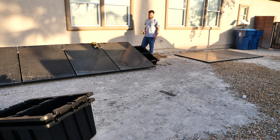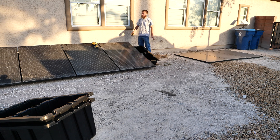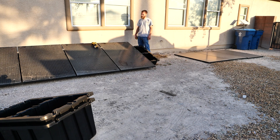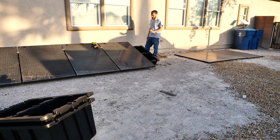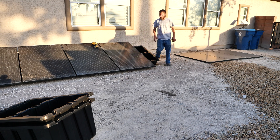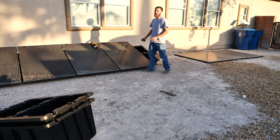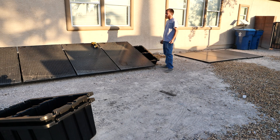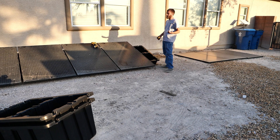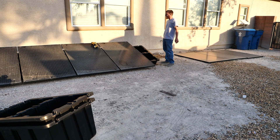As you can tell, the longest time is going to be taking these and filling them with gravel. But the general concept of actually mounting the panels is extremely easy. I am really glad, however, that I'm not filling these with gravel yet, because there is a little bit of adjustment. For example, my measurement off the house has drifted about two inches. With these not filled yet, I can literally take the whole rack and fine tune it right now. It's going to be really easy to just take up one panel, shovel in the gravel, and then put the panel back. For now, I'm going to get the rest of the panels mounted.